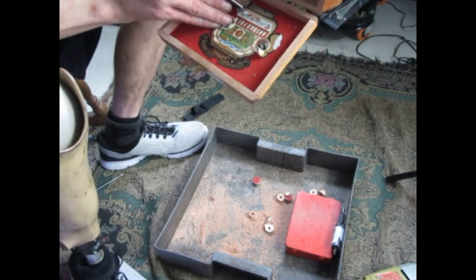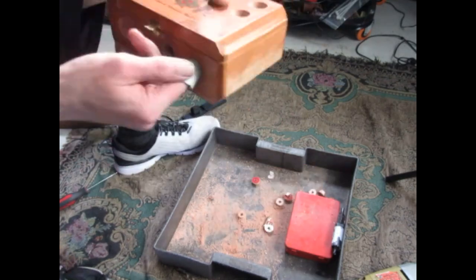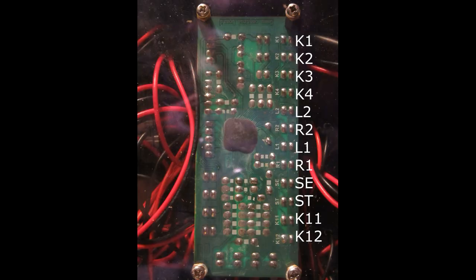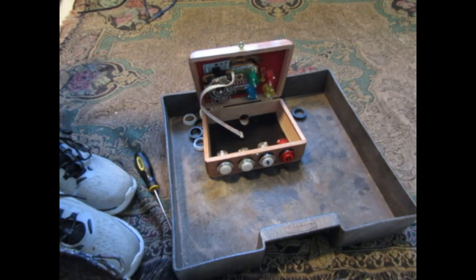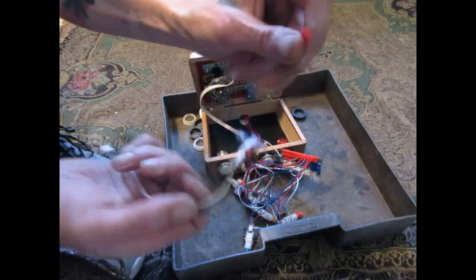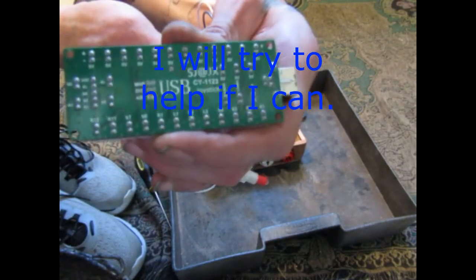As to the type of hardware that you select, I would recommend going with the Japanese Sanwa buttons — that's what I'm using, it's a complete Sanwa build here. Suzo Hap hardware is also really good. Those are the two most recommended ones. Here's the zero delay chip. As you can see, this is where the buttons are placed — they're listed. There's the joystick pin placement, and the opposite side is where the voltage connections are for your LED lights. They're marked on the reverse side of the chip, so you should have a pretty easy time plugging these wires, or these pin ports, onto the pins on the zero delay chip.